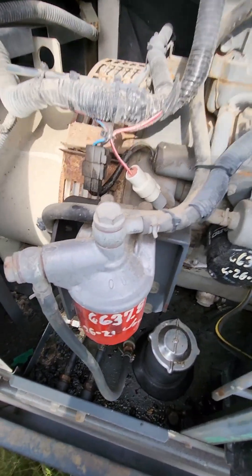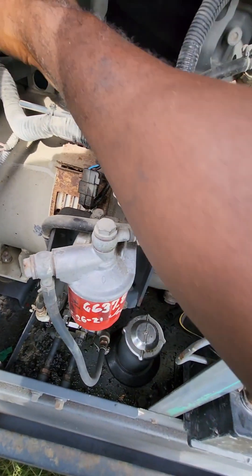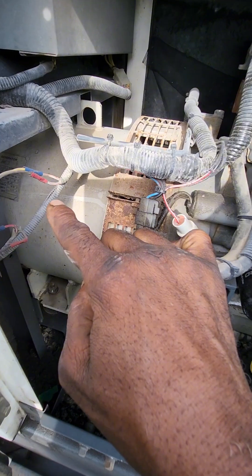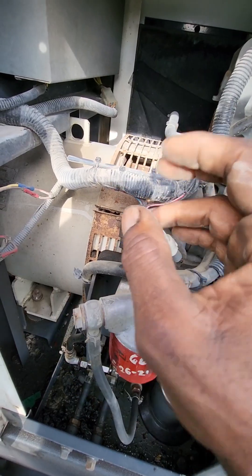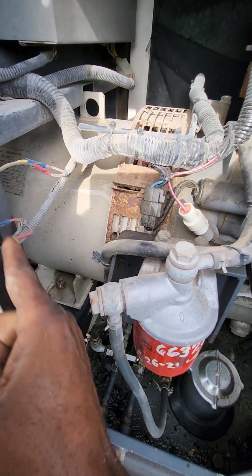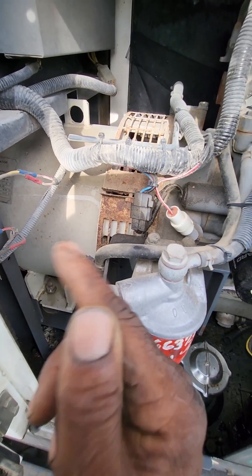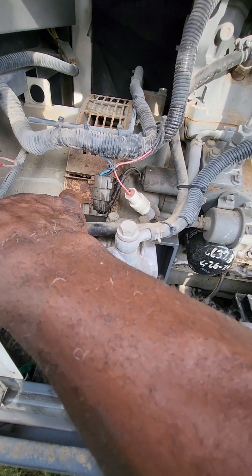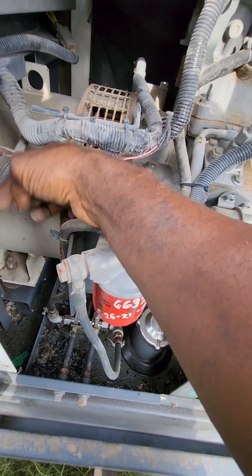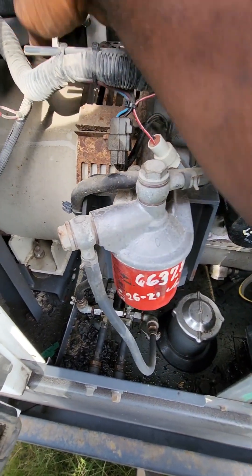To give you an idea of basically how it operates: on the very front end of the generator you have a small generator that puts power from the voltage regulator straight into the exciter stator. The regulator will put in 12 to 50 volts — whatever it's designed for — into the exciter stator. That induces voltage into the exciter armature, the part that spins. The voltage goes through there and converts to DC first, because the voltage generator is AC. Then the rotating large armature in here — your generator armature — induces voltage and produces power output into your main generator.